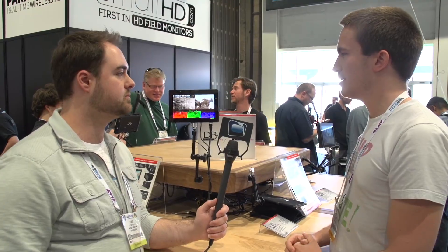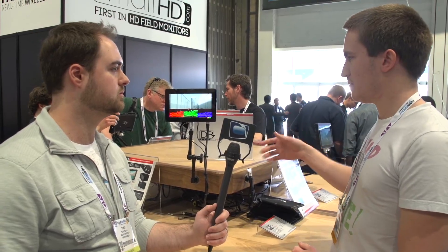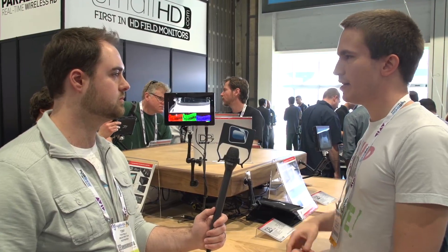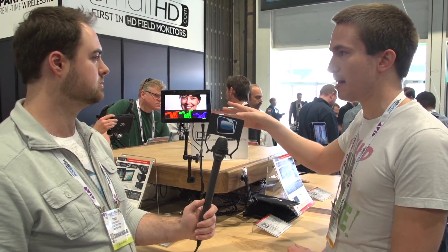Can you tell us the differences between the high bright and the OLED? Basically, OLED is for when you want to see the maximum out of your camera as far as color and contrast range. OLED is very capable at displaying the full range and full gamuts of color — it actually encompasses the Rec. 709 color gamut, and you can limit the DP7 to display just the Rec. 709 gamut or let it go unlimited beyond it. OLED reproduces a very wide level of color compared to LCD. The contrast ratio is also exceptional — each individual pixel is a red, green, and blue light, and when those lights are off, they're black, which is why you get such a deep black point on the OLED monitor.